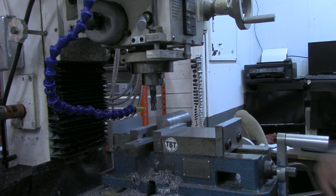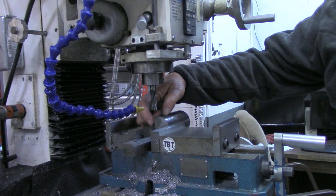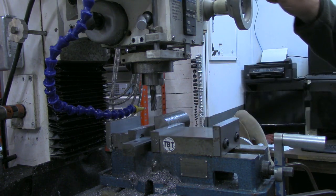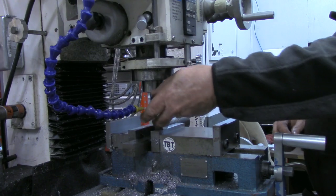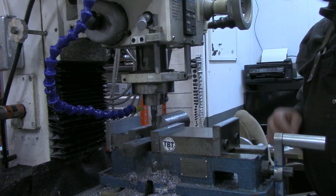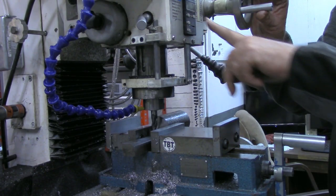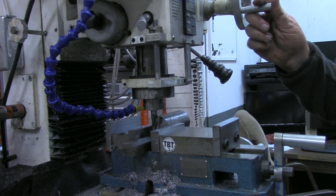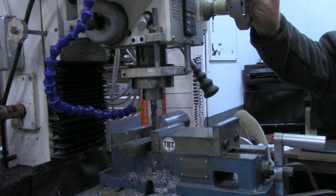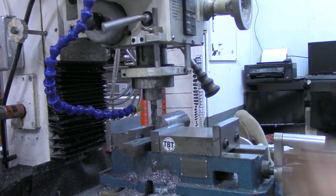But to be sure, when you're doing something like this, two things you want to watch for. One, that you get your desired finished size on your workpiece. And number two, don't run into your vise jaws. So let's come down here, of course, without anything running right now. Got some parallels to raise this up. And let's zero out the Z-axis DRO. We want 750 thousandths, 3/4 of an inch. So let's come up 750 thousandths. It'll, of course, read negative 750 on your DRO.